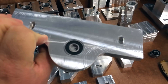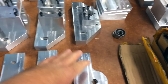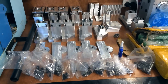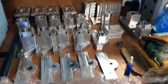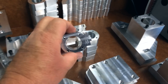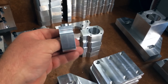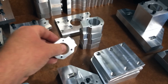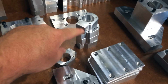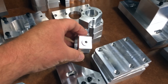You'll see me press the bearings in a little bit later on this. It's all set up ready to go. I'm going to carry on with a few other parts — I've still got to finalise these parts here. So these are the Y-nuts, and they're quite complex. There are about three or four operations in the mill vice that produce one of these. All I've got to do now is bore around the outside here and drill and tap a hole to make it look like that, and then I'm done.